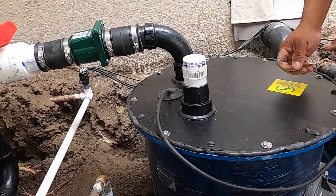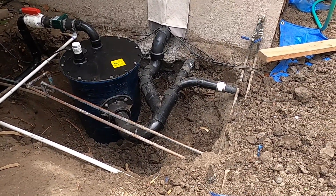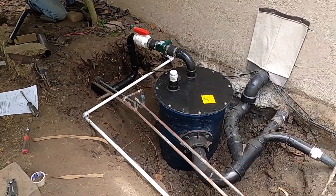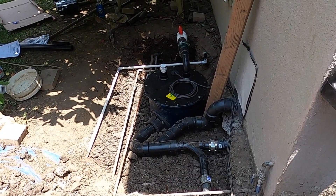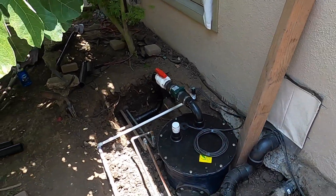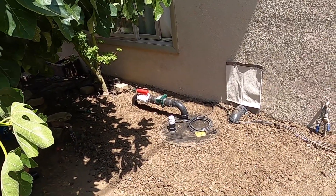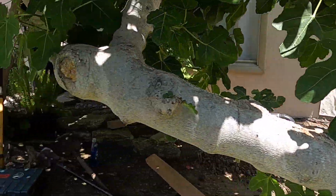That is our final piece. All we have to do is plug this in, make sure our ball valve is open, wait for the glue to dry, and then we'll test the whole system by running all the fixtures at the same time, letting that water go out and checking for any leaks. After that, we're ready to bury this and complete the project. We're already starting to bury and compacting the dirt really well — we've got a 4x4 since a tamper wouldn't fit in this area — compressing that dirt down nicely. And this is what the end result looks like. This bathroom is ready to be used.